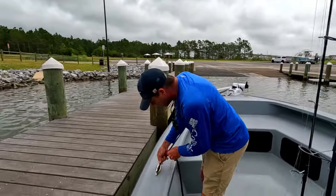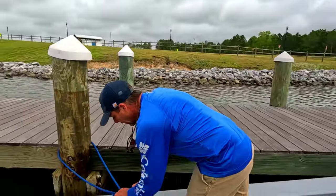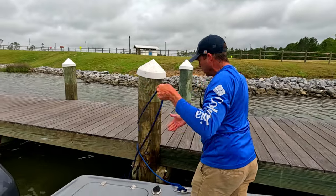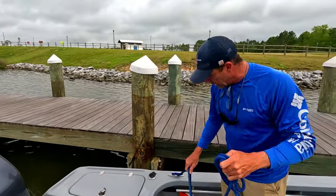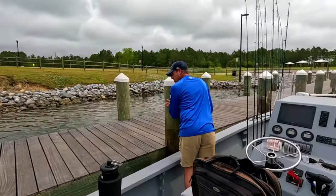On our 29 I like to just wrap the dock line back around the cleat so it's handy when we need it. One thing you don't want to do is have everybody in the boat and shove away from the dock without engines running — that means you don't have the boat under control. Tide water, wind, or another boat's wake could move you and make you lose control. We've got a light wind pushing the boat into the dock.